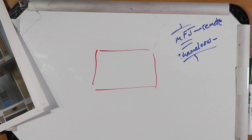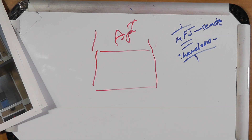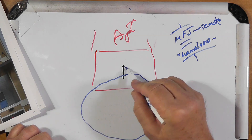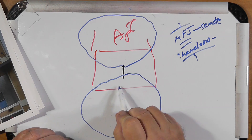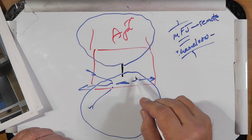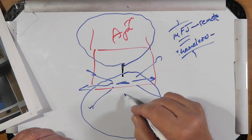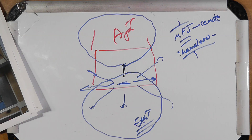So here's your balcony with the apartment behind here. The magnetic loop is here. Now, what is the pattern for this loop? Well, it's off the ends. And note that means into your apartment as well. If you put it this way, you're going to be trying to radiate this way, and it'll go out to the sides and all that. But if you put it this way, you'll get a nice radiation lobe going off that direction. And you said this is uncluttered to the east. Maybe you get some overseas DX or something like that.